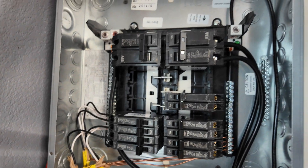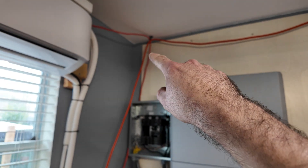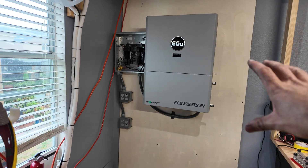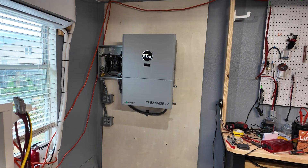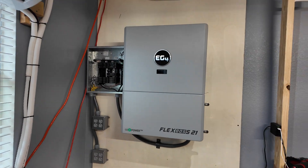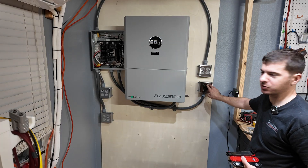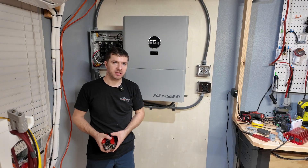Give me your honest opinion on how the wiring looks - if it looks bad, I can take it. We're going to replicate that on the other side and I'm going to run the conduit up and over and back down to give as much headway above the unit as possible for airflow. I want to keep all the AC wiring on the top area so the bottom area has tons of space for battery cables, bus bars, and battery racks. Huge update - after a couple hours I've got pretty much all the AC wiring done. We have our two four-plex outlets, one NEMA 14-50 plug installed so we can power any 240-volt appliance directly from the inverter.